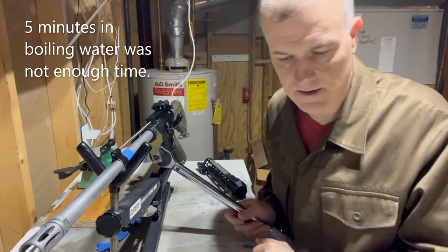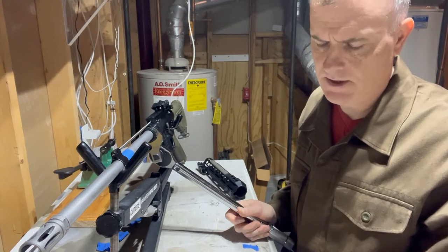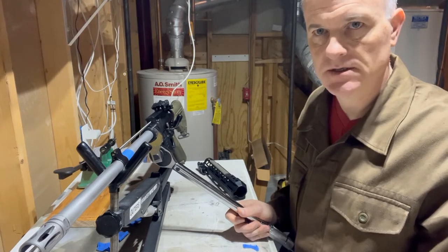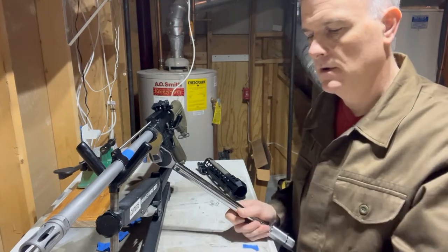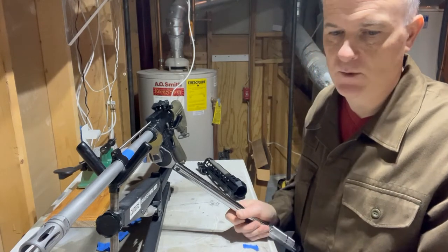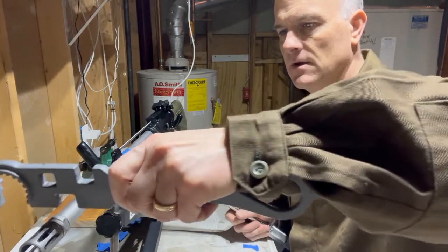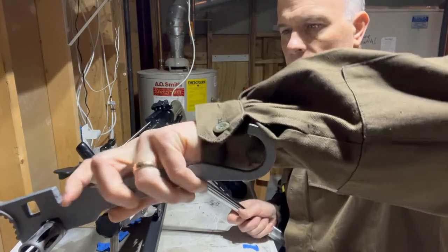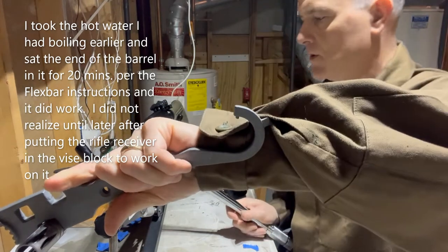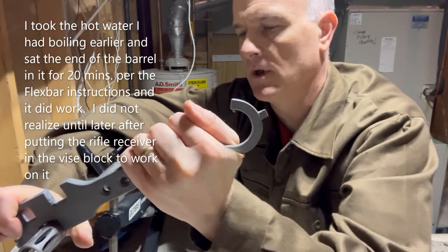All right, so I went back to YouTube and found a video done by the Flexbar Corporation. I think they're the ones that produce Rocksett. Their method was to sit it in hot water for 20 minutes. Their example was they glued a handle on a mug, then put the mug in the water for 20 minutes and the handle fell off. I'm not sure that's exactly the same as the situation I have here, but it's quite a different method: longer time, not necessarily boiling water.